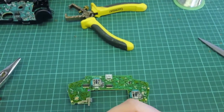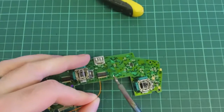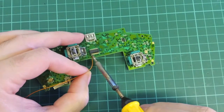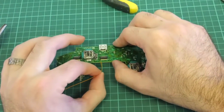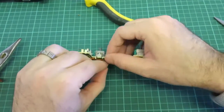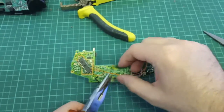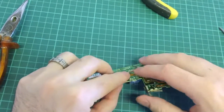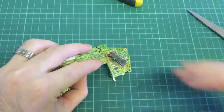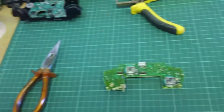The first one here is a ground connection. Once you've made your connection, give it a little tug — not hard, just enough to make sure you've got a good strong connection and it's not a cold solder, where it's just stuck on top and not actually fused in with the metal. This one is going to the same earth connection we put for our chip — just a quick dab of solder on there and onto the next one.